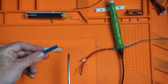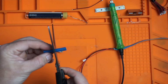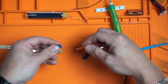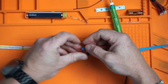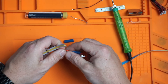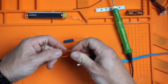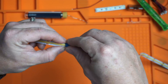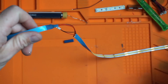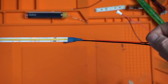Don't forget to put the heat shrink on — it's always easier to slide it on before soldering. I forgot on one side; on the other side I did not. Go ahead and slip it on while it's easy, because you can still slip it over the LED but it's much easier to do it beforehand and it makes the finished connection look a lot better. That's how you get that clean, professional look.